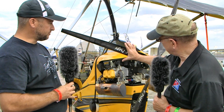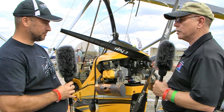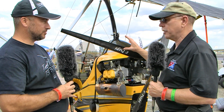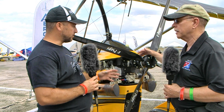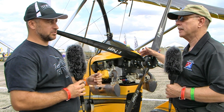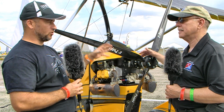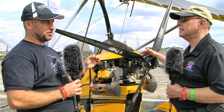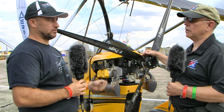The Sensenich is a wide two-blade prop. Is it more blades, the shape of the blade, or both contributing to the smoothness? Probably the number one thing is it's a super low inertia propeller. This prop with all four blades — even their six-bladed propeller — weighs about half as much as our two-bladed propeller. That's a huge difference in weight.